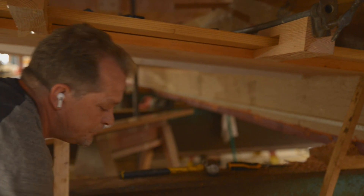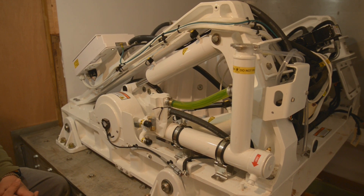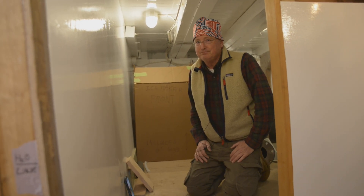Now that the gyro is installed, it's kind of funny — the last several months have felt rather strange. This is the first time I've installed a gyro on a boat or seen one installed, so it felt a little like overkill up until now — the double planking, the stainless steel floor timbers that go from stem to stern. But when you see this machine down in the boat it suddenly starts to make sense. It's an amazing piece of equipment and it does put an enormous amount of stress on the boat, so we overbuilt the boat so she can withstand those forces. The gyro's finally in; now it's time to build everything around it.